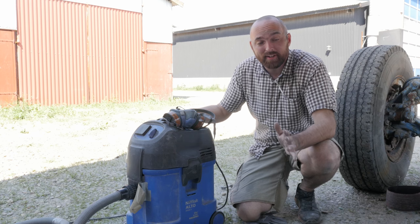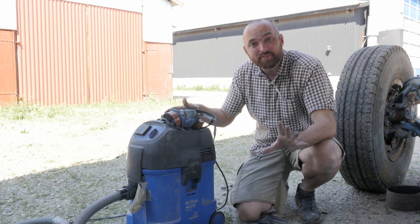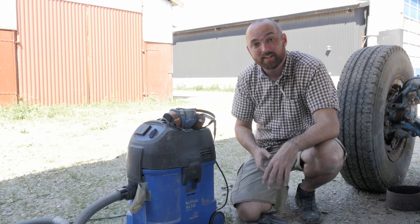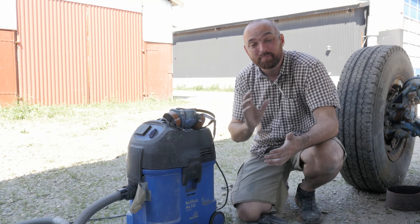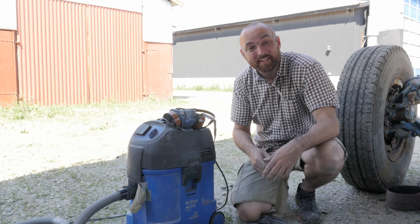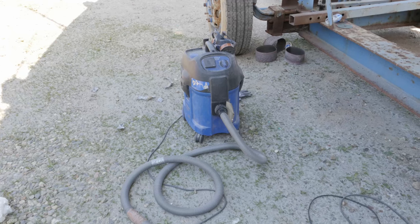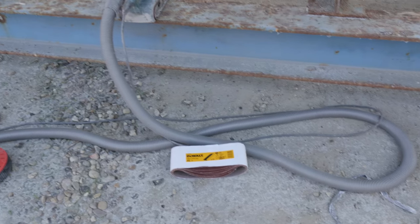When sanding antifouling, I'm required for environmental reasons to hook up whatever tool I'm using to a vacuum. That vacuum hose was briefly visible in the last video. So what I did was I sanded off a large area of antifouling without sanding through the barrier coat, then I removed the hose from the random orbital sander, because that hose limits my movement quite a lot. So the dust I was covered in that previous video was actually from the barrier coat and not the antifouling. I do believe that the dust from the barrier coat is relatively inert when it comes to skin contact — and my exposure here in the grand scheme of things is very limited. Having said that, of course I do wear a mask and some other protection. Since then I've got my hands on a different vacuum with a much, much longer hose, and having that extra long hose makes all the difference.